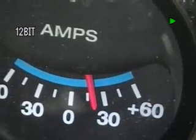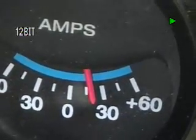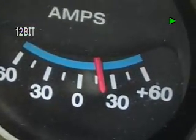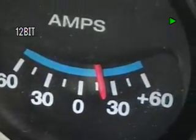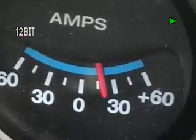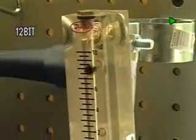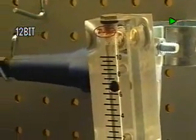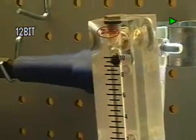So that'll give you some idea — the more amps you have, the hotter it is. If you can pull the heat off, you eliminate the boiling problem and get more HHO. Thus, you can take a unit that does 2 to 2.5 liters a minute and push it all the way up to where it runs in the 4 to 6 area, peaking up at times at 10 liters per minute.